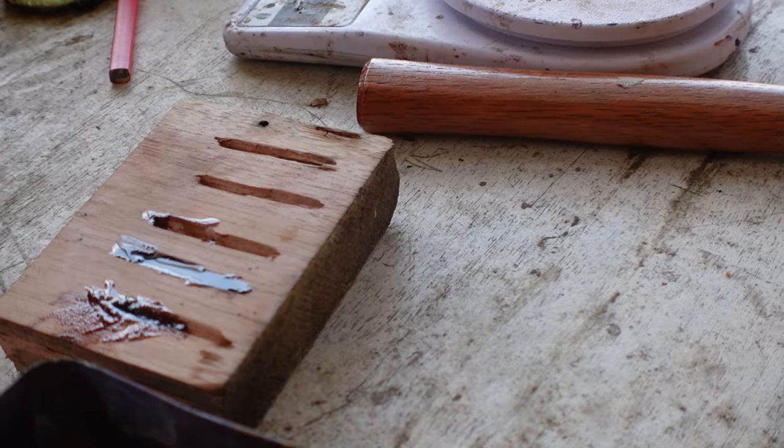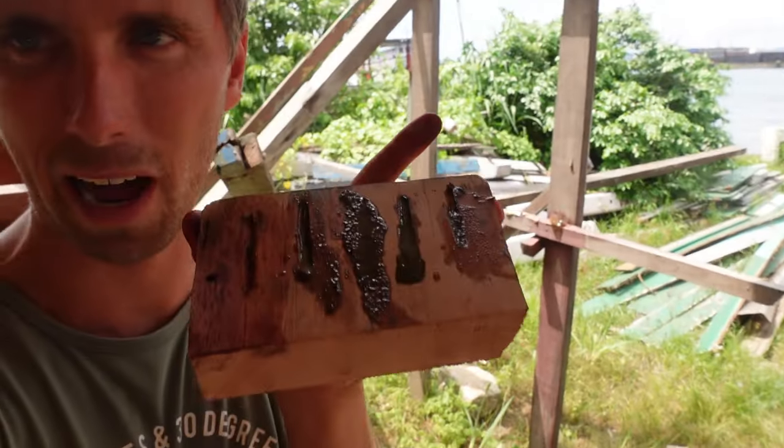I'm not sure if we got anywhere with this, because we just got a whole palette of very, very dark colors. So we are gonna let it dry over lunchtime, sand it down and varnish it, see what it looks like. This stain, I guess it's kind of stain, you mix it with ethanol actually, and you paint a wood. So you mix, let's take a wood that everyone kind of knows here, chestnut. You mix 15 grams of this powder with 1 liter of ethanol and you just use it as a stain for a wood. So we actually made quite a bit and we ended up chucking it away.